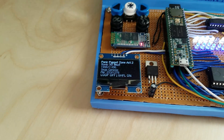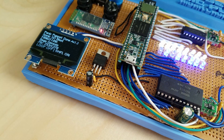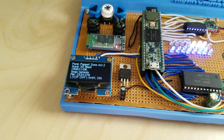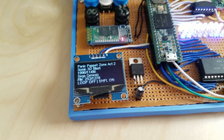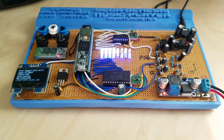I've changed the LCD color — it's just a white one now. It's removable and it's running off its own little voltage regulator power source. It used to be running off the Teensy's 3.3 volts, but the I squared C bus — you can probably see how it's refreshing on the screen right now, how it's kind of flickering — that added a ton of noise. So adding its own voltage regulator really helped out.